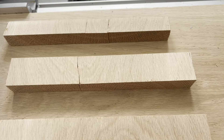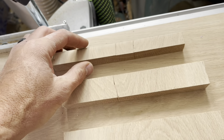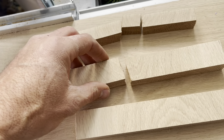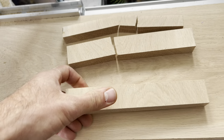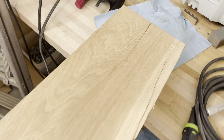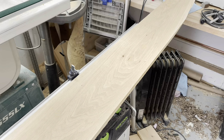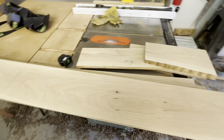A little pro tip: when boards are acclimating, the ends typically split a little bit. I could see a small indent, so I started by cutting just an inch off — that board broke very easily. I took another inch off, gave it a stress test, and it broke fairly easily but not as much as the first. The next piece held up, so we know we cut past the split. The other end is already starting to split so we won't use that part. Typically we're only using about seventy percent of the lumber we buy, even in S3S condition — even less if it's rough.